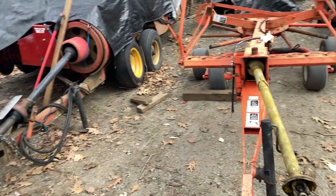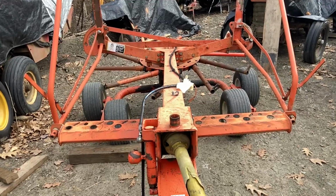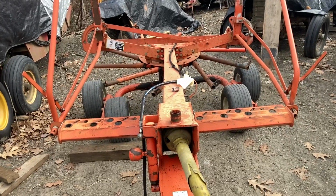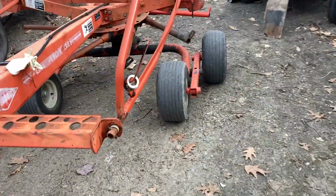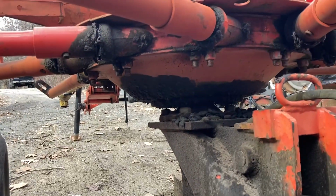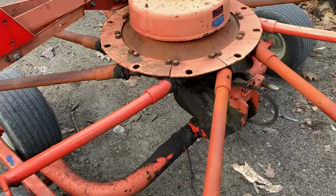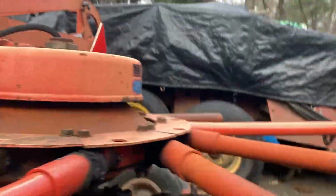Okay, well, I'm going to try it on the 275, but I can't figure out why the axle has play in it. As you can see, it is pointed off to my right, it's left. And I noticed as I drove with it, turning, it would kind of steer and follow by 5 degrees maybe. And it doesn't look like any of these bolts are loose. It looks like the play is up internal a little bit, which is not what I wanted to see. So hopefully this is not going to turn into an onion project here. Oh dear. I don't know if it translates to video, but you can see that turning a little bit relative to it. And it's a twist all the way up inside, not from those bolts.